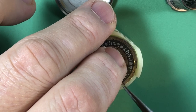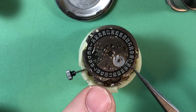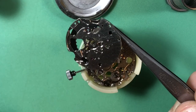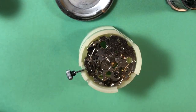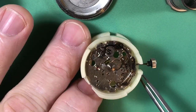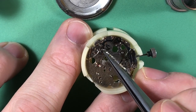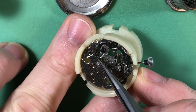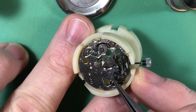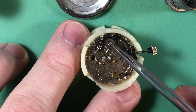Pull this off because I want to look at some of the stuff on this real closely. The whole calendar plate comes off - you can see the lower mainspring arbor jewel there, that's important. This whole assembly comes out - this is what makes a 6138 a 6138, all of this stuff. You can see all your operating levers right here. What's weird - it looks like it's been blued. This is a nice movement, I think this is a nice movement.